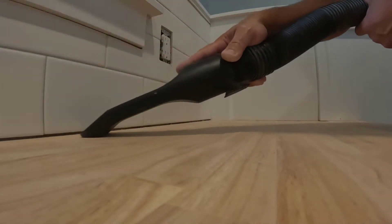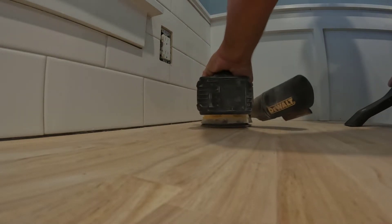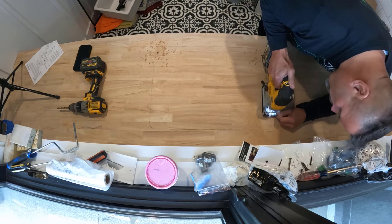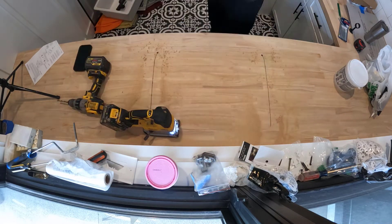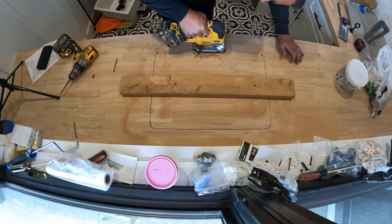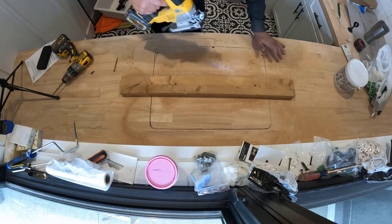The palm sander is going back to work, just getting a couple of bumps out and cleaning up the adhesive. If you haven't dealt with butcher block, it's a good quality product — 100% wood, a lot better than Formica, and the look is phenomenal. After sanding and cleaning it, I'm now cutting the sink hole, which was nerve-wracking. I used a jigsaw here — probably should have used a router for a cleaner cut — but I figured I could make up any differences with the palm sander. It turned out pretty good; one back corner isn't perfect because the jigsaw blade bowed a little on the radius, but I was able to clean it up.